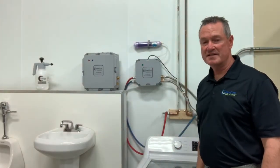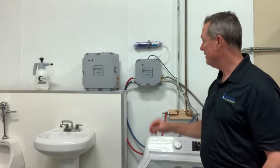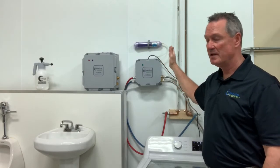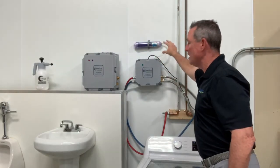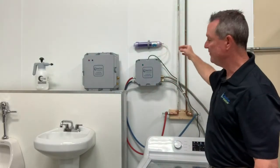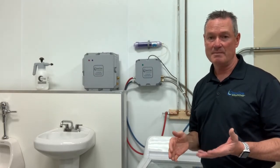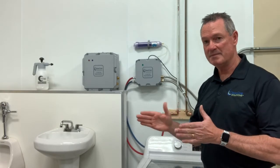Above the unit, you can see that we have an air dryer. There are beads on the inside of the air dryer that are purple or blue in color. When those get pink in color, that's when you want to slide that unit off of the C-clamp, take off the copper fitting on the side, take off the tubing, and simply put it into a microwave for 30 seconds at a time until that pink becomes blue again.